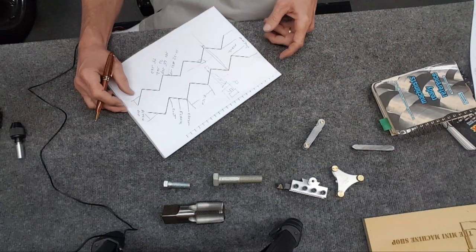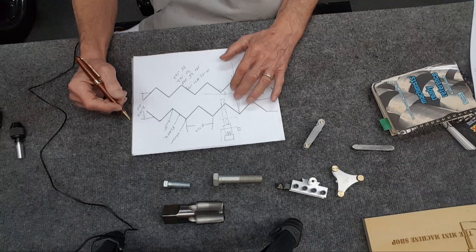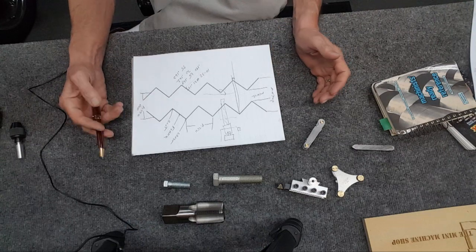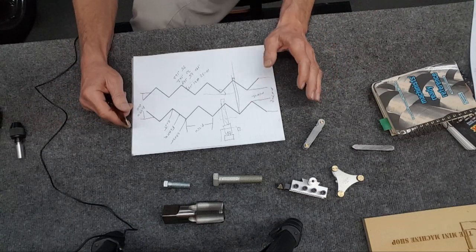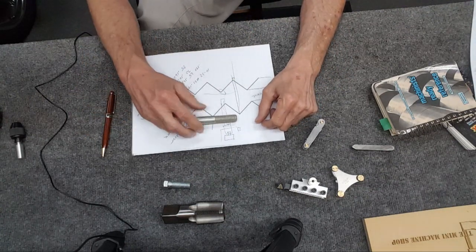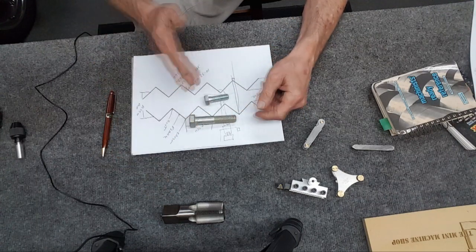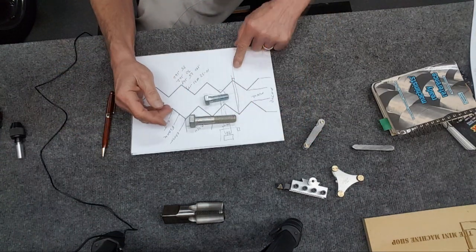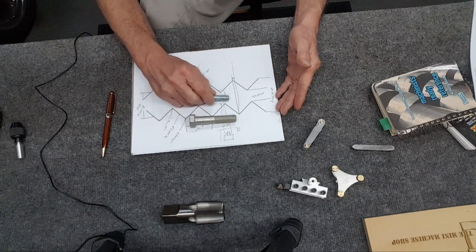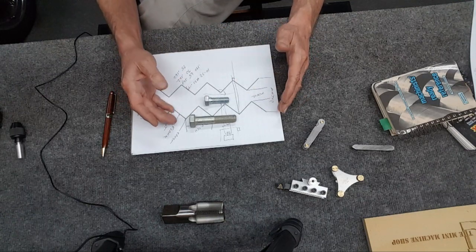Yeah, all right. The website, the Greene Tool Company Systems, has a calculator for this angle. And I started just for the heck of it. Evidently, it's for imperial only. Because you plug in metrics and you get like 85-degree angle. Like, no. But evidently, it wants diameter and threads per inch. Seems like every single screw I plug in has a different helix angle to it. And you look at them, and they look the same to me, but they're really just slight, 1.5 degree, 2 degree. You can't see it.